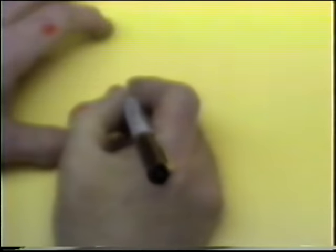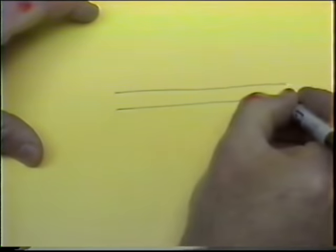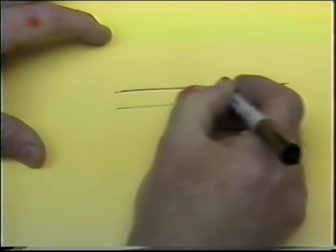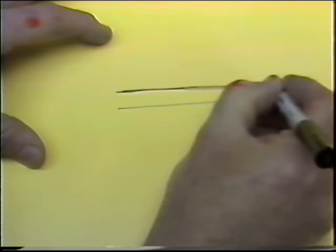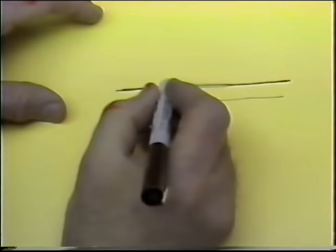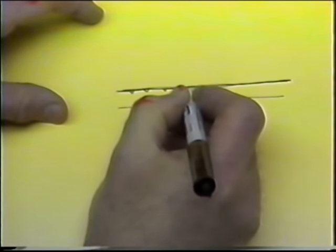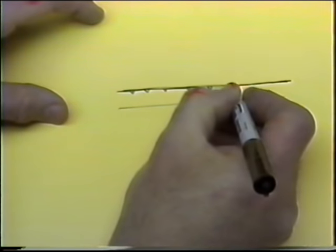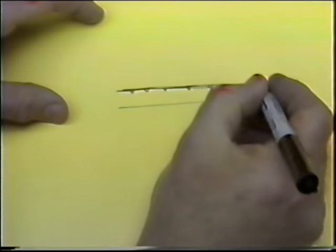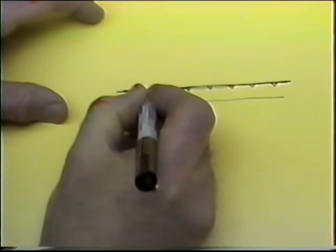What happens? When aeropoxy light dries, it usually will have a very high gloss, smooth surface, especially if you've wiped it down with your finger, a prop, a marble, the round object of your choice. This shiny surface needs to get sanded. Now the reason for sanding is not really to change the shape. I'm real happy with the shape. One or two coats of primer on that, the shape will be fine. But it's the tooth. I call this a tooth.